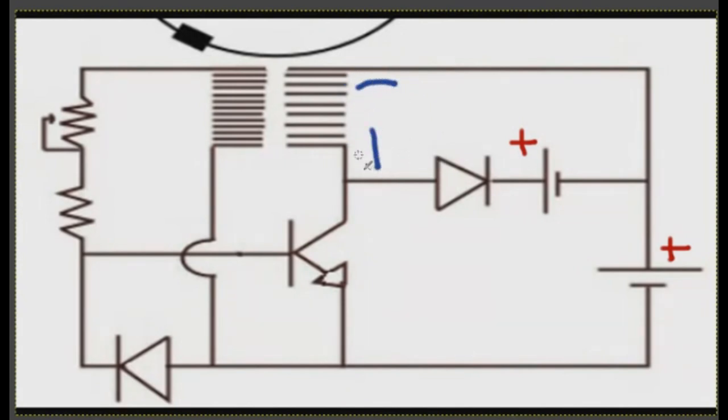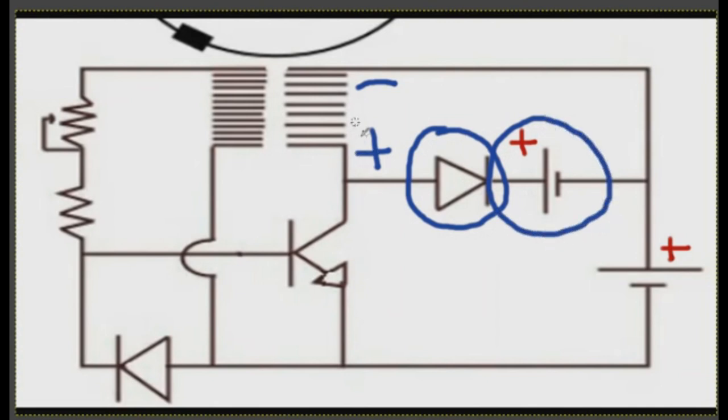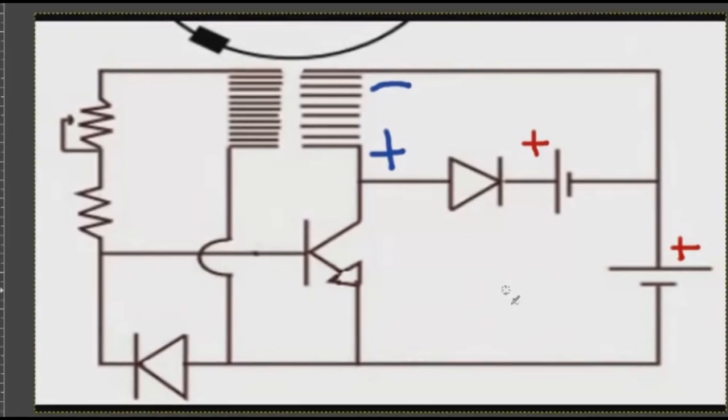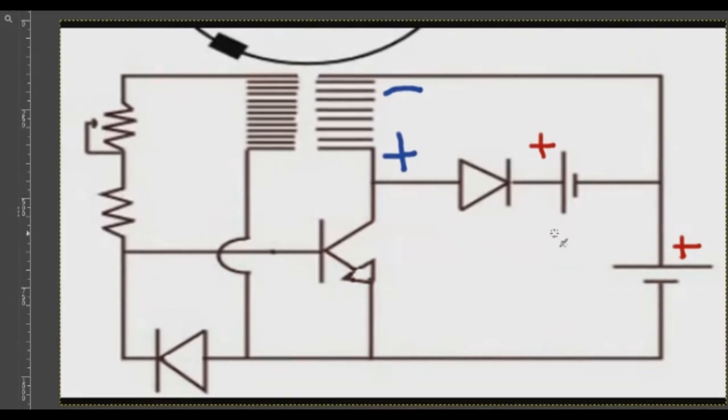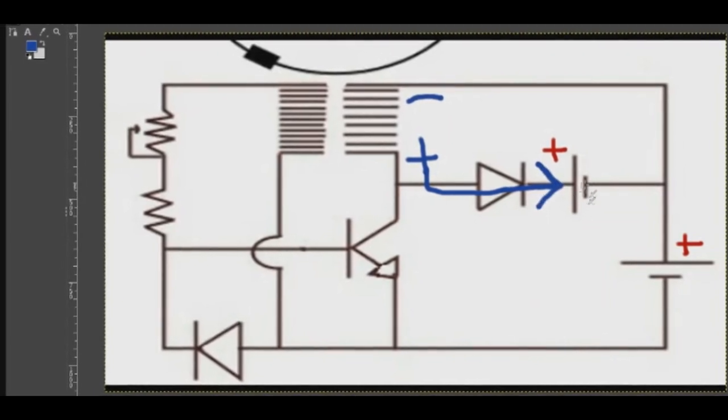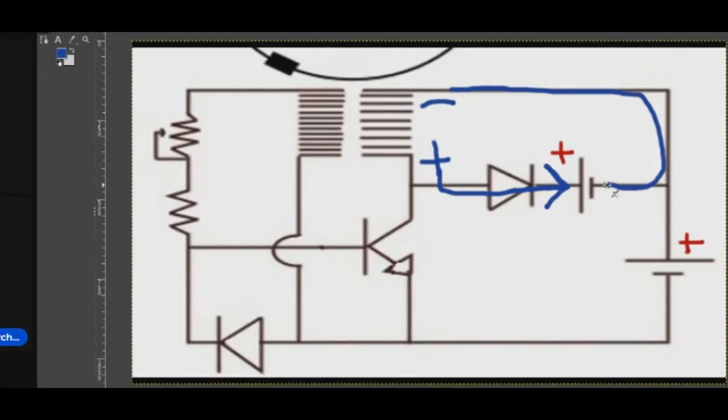Now looking at this high-voltage diode and the second battery — high voltage positive and high voltage negative. A 4007 diode can handle around a thousand volts; higher-voltage diodes handle more voltage but less amps. When the polarity flips, the positive can now pass straight through the diode in the correct direction and hit the battery, charging it up, while the negative closes that circuit.